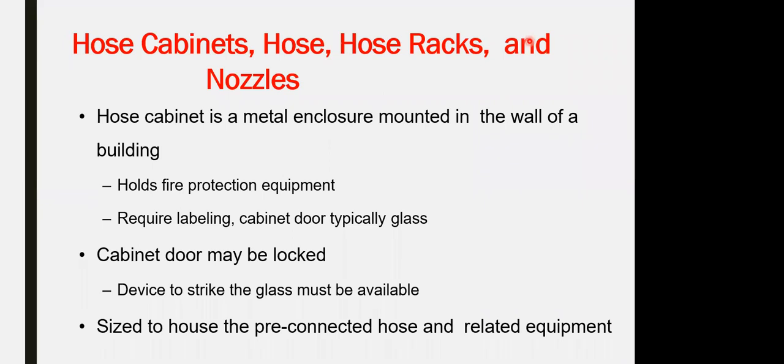But civil defense are testing and certifying and checking the test submitted and the sizing of the pump, the temperature, the operation, etc., according to the catalogs, the data sheets and the certificates you have, so we can approve the pump itself to be certified or accepted by the civil defense. So first, it has to be accepted by the civil defense. However, when you are submitting for the fire pump, for example, you have to make a factory test for all the pumps, certified and witnessed at the factory, and provide the test result for each pump. Submit it to the civil defense, in addition to the site acceptance test, certified by a third party and witnessed by a certified QCD engineer, and submit it with the civil defense inspection request.